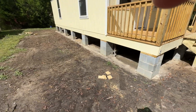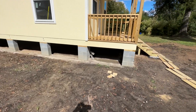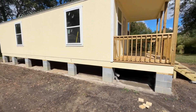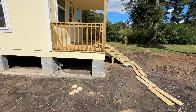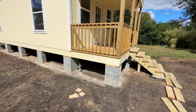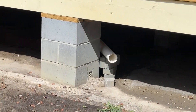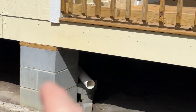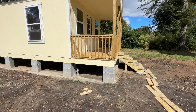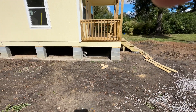Let me show you here — these are the things you have to think about when you're doing stuff like this in a place where water builds up. Right here are these two piers. They'll be able to brick all the way around the house up to here, but where the porch is, we're just going to have to brick around those three front piers and leave this open for drainage. You can't encapsulate water. The brick will go all the way across the front of the house, from that pier to the back, and just leave this open because essentially that's a deck — it's a porch. We have to be very careful because I could get in trouble with water encapsulation.